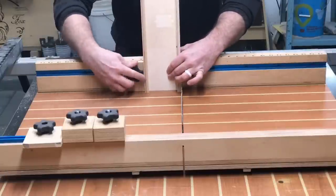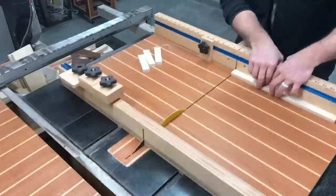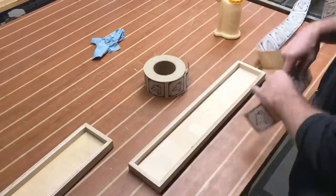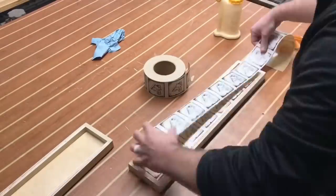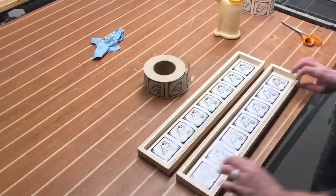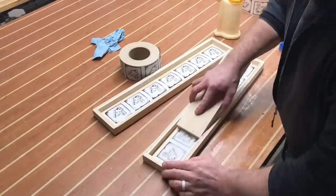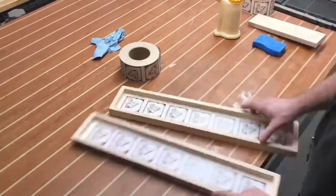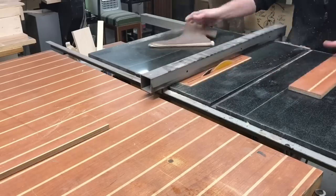Yes, big surprise — I'm using Baltic birch plywood. These are essentially going to be trays or troughs for the logos to sit in. As you can see, I'm assembling with glue and brads — pretty simple construction. Then I'm taking some shipping tape and cutting it to length so it fits inside the troughs we just made. If you've ever ordered anything from me, you'll recognize this tape. It's self-adhesive — you just wet the back — and I'm going to use its logo to become the ornaments.